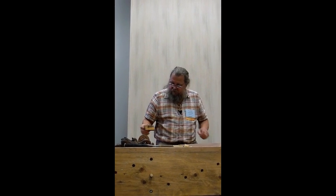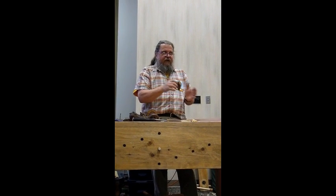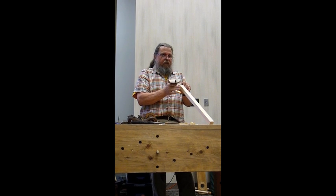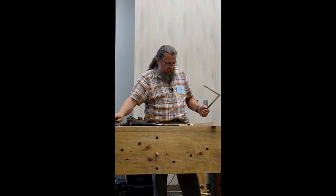So what we're going to do here is first lay out by hand. Then after I've got my dimensions, I set this thing and it's going to mark. I can transfer this mark for the mortise and the tenon, because I'm marking it off the back, where everything is flush. Normally things are laid off the center line, but because it's all flush in the back and the pieces aren't the same, I can do that, but I'm going to do this by hand.